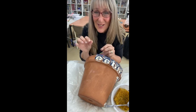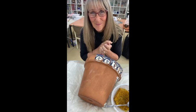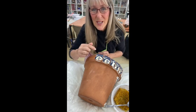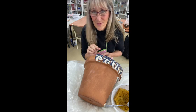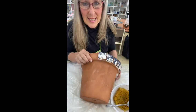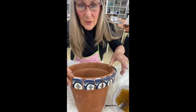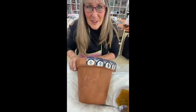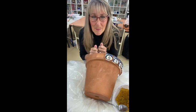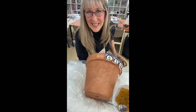I'm going to let this sit on its side for at least an hour so it won't slide off when I move it again. The other thing to do before it dries — in about 15 minutes — come back and check to make sure you've got all the glue off the sides. As I've been working I've been removing the glue that was oozing out from the top and around the sides. Do this before it cures because once it cures it's too hard to remove. Also remember to keep your hands clean as you go.